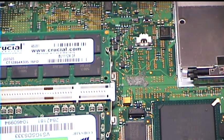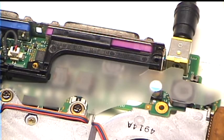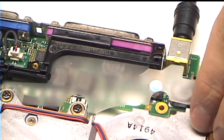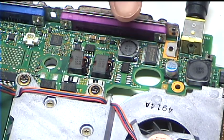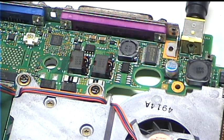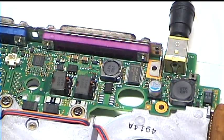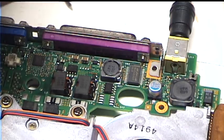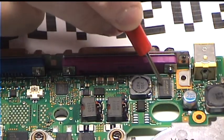So then I went and figured out where that power rail came from. It turns out that VCC3M is produced by a buck regulator from VR2, which is conveniently located directly under this cover. Okay, so there's VR2, the Max 1631. So that's a buck converter chip. Now I looked at it, the voltages seem mostly fine. So I knew the Max 1631 wasn't turning on.